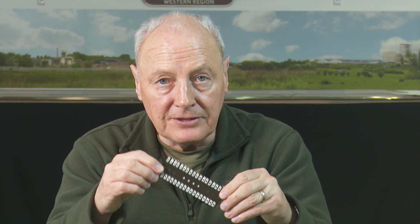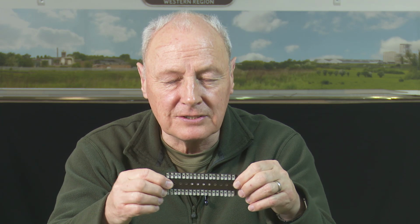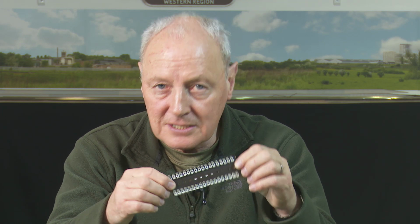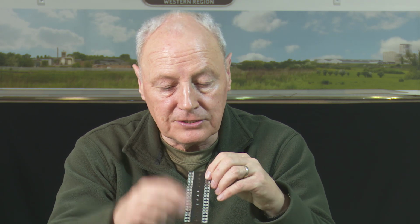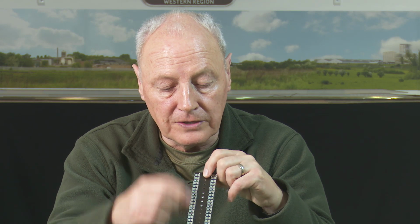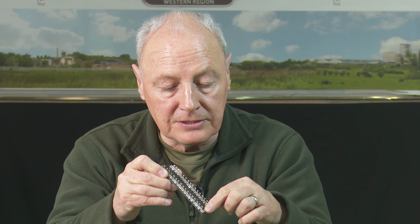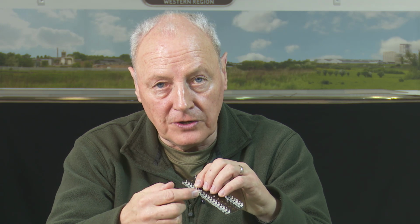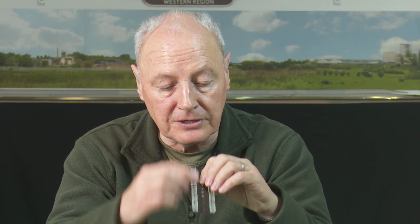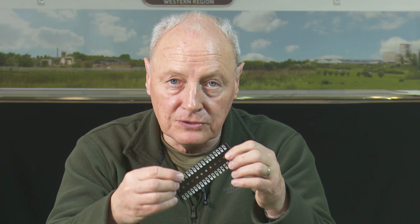Moving on from there, I then went into using tag strips. Tag strips are available from Squires, that's squirestools.com, for a staggering price of £2.99. As you can see, there are 2 complete sets of contacts, and every contact here is independent. But if you were to solder one piece of wire all the way down the inside of the contacts, then you could apply power on one and take it off on all the different contacts, and therefore you have a kind of bus bar there. Similarly, you might do one side for your black cables and one for your red. All makes sense.